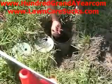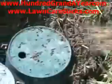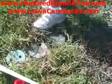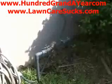And after I fill in the rest of the dirt and put the grass back in there, I'm going to turn the water back on. And when I do that, I'm going to do it very slowly because the pipes are full of air because I drained all the water out of them. And if we turned it on right away, we would have a great rush of water that could possibly compress the air, which could cause us problems down the line.